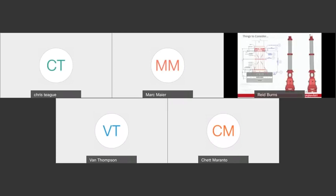And you also have to be especially precise if you're using a stacked track arrangement. So that means you may use that in cases where you don't have quite enough stroke with your gantry leg by itself, and so you need to get that base unit up 4 or 5 feet. And so remember, if you are stacking that up, everything that gantry leg is on, if it's out of level, that gantry leg is correspondingly out of level, is proportionally out of level, is a better way to say that.